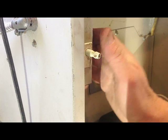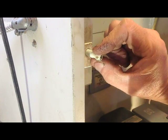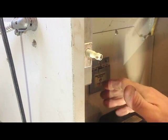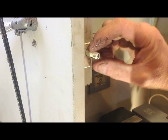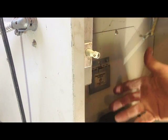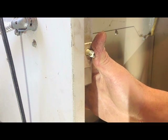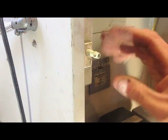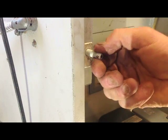Before I turn on the power, I want to make sure that this switch is in the center position. All the way out is service mode — it will allow the burner to run with the door open. In the center position, it will not allow the burner to run. Once the door is shut, that keeps the switch in and allows the burner to run. I'll leave it like that, go turn it on, and when I come back over I'll pull the switch and it should fire up.